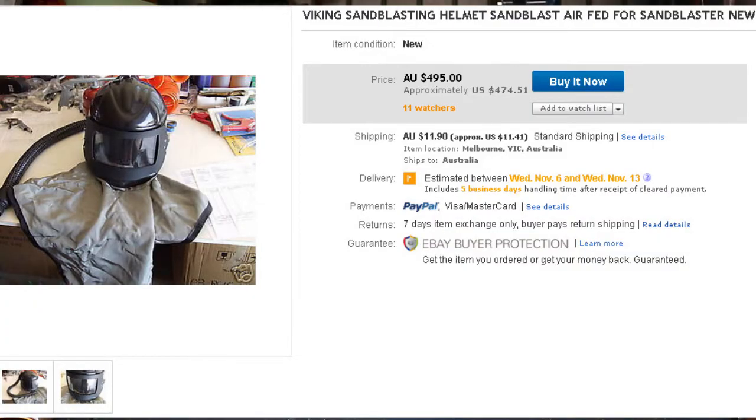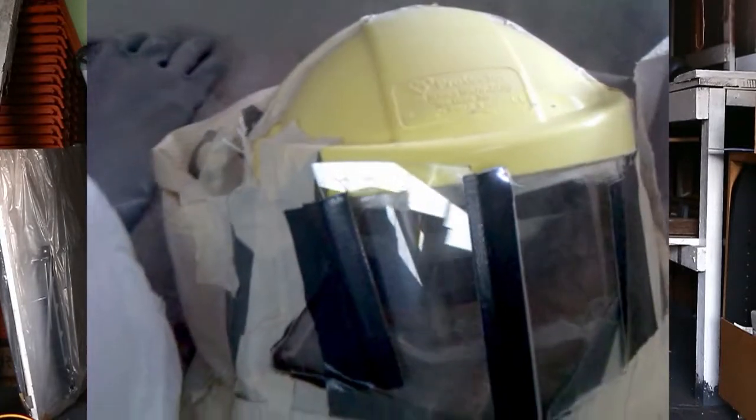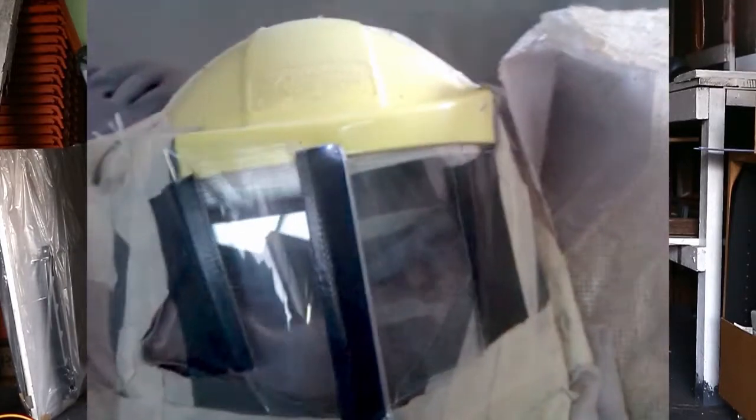What I found was you've got to have glass. I looked online and found a specific sandblasting helmet — it was $500, and I wasn't going to pay for that. So I made something out of a plastic grinding visor, and just took some window glass and taped it over the top to stop the media from matting off that plastic. With this face shield, I taped the hessian bag from the blasting media on the back to stop it filling with media from behind, and taped an old t-shirt down the front to allow a bit of air through. It was big enough to have hearing protection underneath, and a dust mask as well.